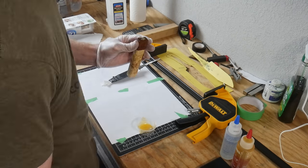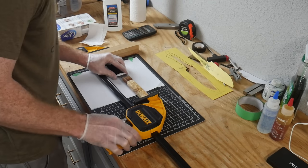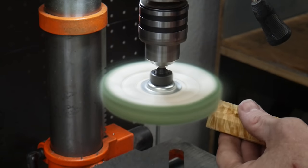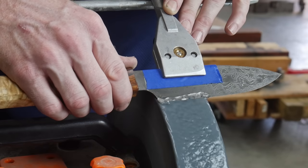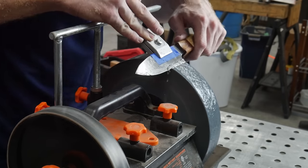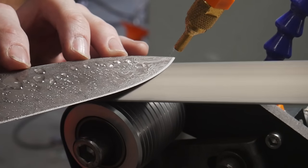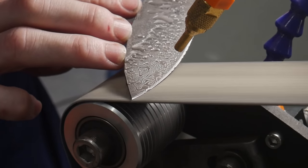With the blade complete we can now glue on the handle, which is about 95 percent complete, using G-Flex epoxy from West Systems. I also purchased a large 24-inch DeWalt clamp for this project specifically. Once the epoxy has cured it's time to finish the back end — I brought it up to a thousand grit and put a small radius on the edge by hand. Normally I'd go straight to my Houseworks sharpening system on my 2x72, but with this knife I wanted to hit a specific secondary bevel angle of around 17.5 degrees, so I set the angle using my Wicked Edge water-cooled sharpener and then moved over to the Houseworks system to refine the edge at a higher grit.